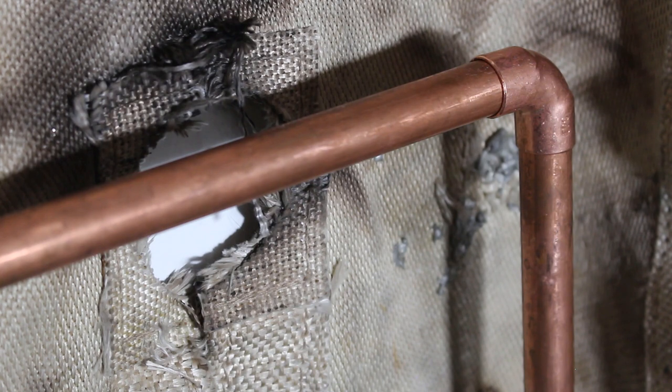So the only connection you really want to make is your last connection in that tight space. Let's say we already dry fitted our piping, all our other connections are complete, and all we have to solder last is this elbow. We've protected everything we didn't want to burn with the fire barrier, and now we can move on.